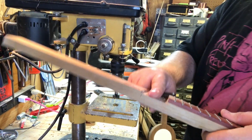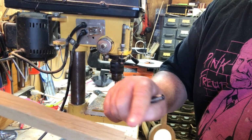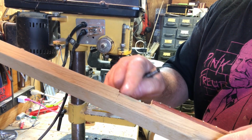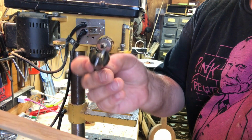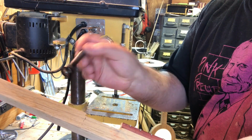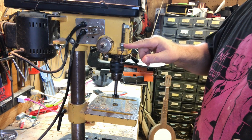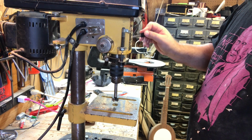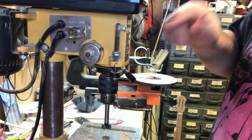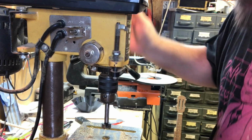All right, I need to clear out the wood in this CB Gitty neck. I need to go down, I'd say about 1/4 inch here. And the way I'm doing it is with one of these. This is a Forstner bit. This just digs right into the wood and clears it. I've got one in here right now. And what I did was I set my drill to only go down that 1/4 inch that I need, and it stops there, so I have a nice uniform pull.